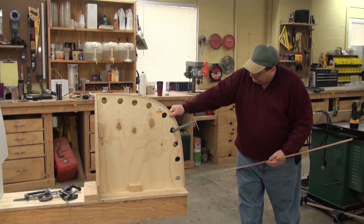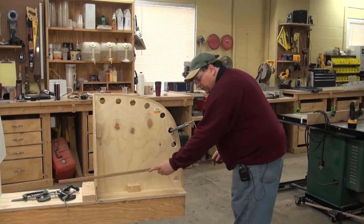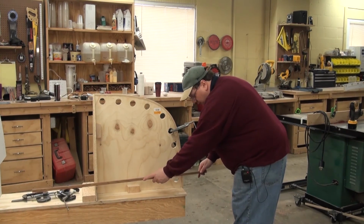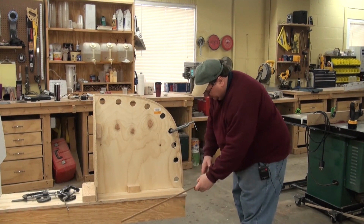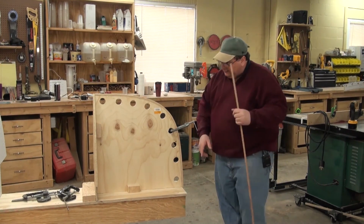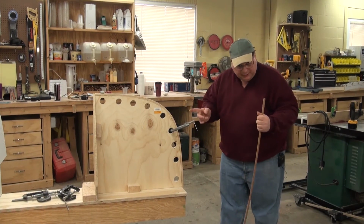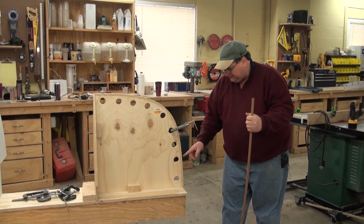Well, the stem is basically the same type of thing that we just did on the transom. We want the strips that come around from the front of the boat to land nice and flat here. And obviously right now we've got a peak, so they're not going to lie flat anywhere. That's why we divided this. Now that black line that I drew back there is the don't-go-beyond-this-point line. It's basically the lines that we drew on this, right? We divided this into three.